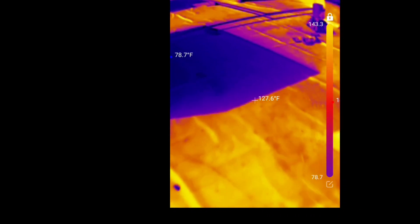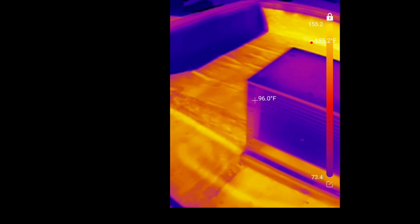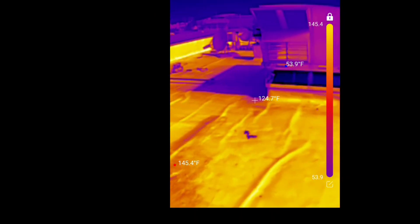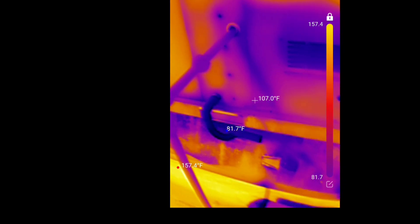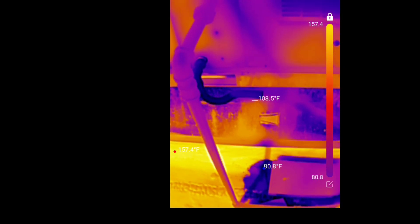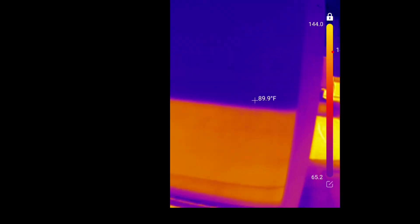Look at the roof — it's hot. Our ice machine condensers aren't running at the moment, and this rooftop unit here isn't running either. This dark blue area that looks kind of like a shadow — that's just condensate water dripping down, nice and cold. You can just walk right up to this thing and tell which circuit is running, top or bottom, just from the thermal image.